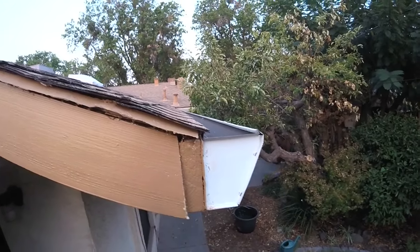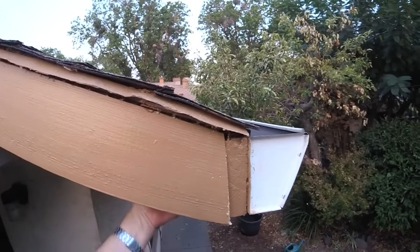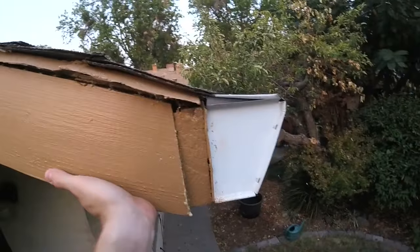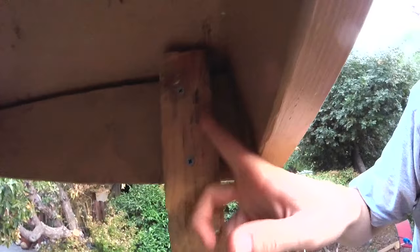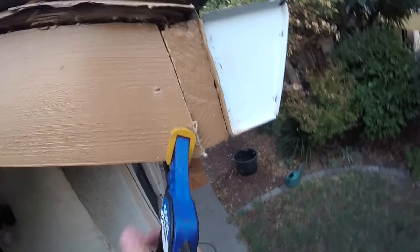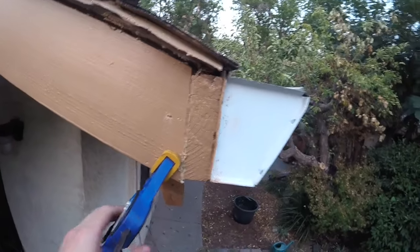On this bottom joint, we could remove the gutter and go straight into the end grain, but I'm just going to do a few toenails — two on the back and one on the front. It's going to be a little tricky because this wood is a little warped. I screwed a little scrap block underneath so we should be able to pull it in with a clamp, hooking it onto that scrap piece. Looks like it's working — there we go.